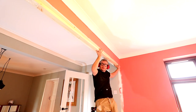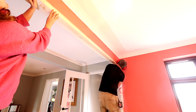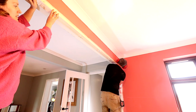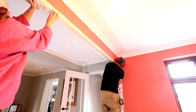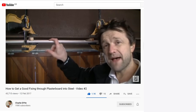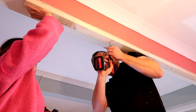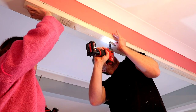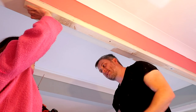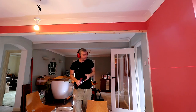Next I can get my top plate fitted, lined up to the laser again — no cuts were needed so I'm using a 2.4m length for this. I asked Ria to hold it in place while I got the first fixing in. To fix to the steel I found a great video by Charlie White which explained how to fix to an RSJ using ordinary screws — by using a screw size half a millimetre bigger in diameter than the pilot hole drilled into the steel, you can get a really solid fixing with ordinary screws that self-tap into the steel. I found that using an impact driver and driving the screws in bit by bit worked well for me. Great tip and a great channel — I'll link to it in the description box below.